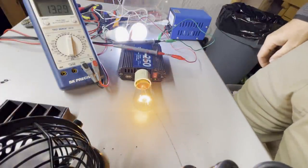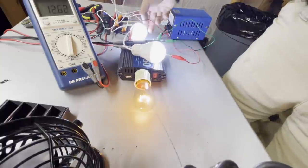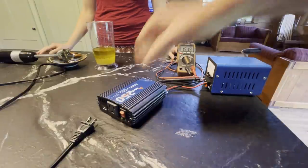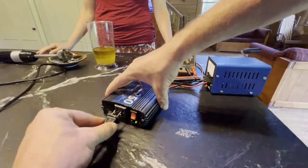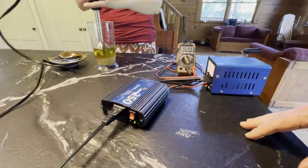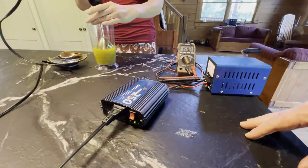The problem here is that the inverter is a high wattage device, and the supercapacitor power bank does not hold a lot of energy for high watt loads over long periods of time. However, it was still fun to experiment and see what we could do. If the hand crank generator had a larger handle and a different gearing ratio, this might be more practical.